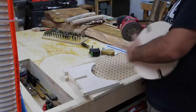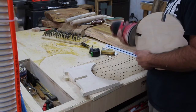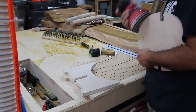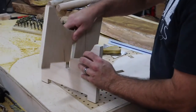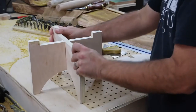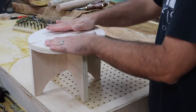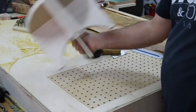Getting back to the project — this is the part where I'm sanding out all of the imperfections. I could have used a circle-cutting jig to get a nicer round top, but I free-handed it, so now I'm having to go back and sand out the imperfections. But now you can kind of see how this is going to look. The two leg portions fit together with those slots to create the base, the top goes on, and the notches and through tenons fit together nice and snug.